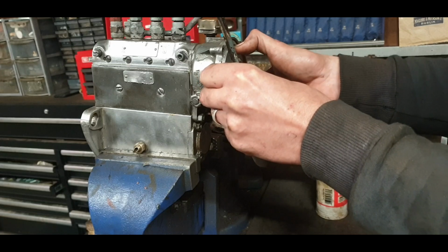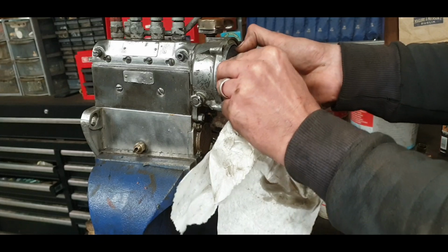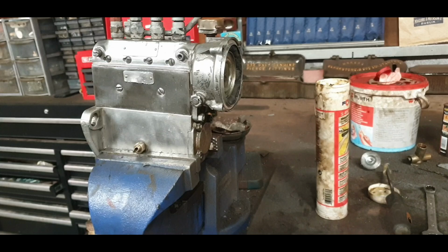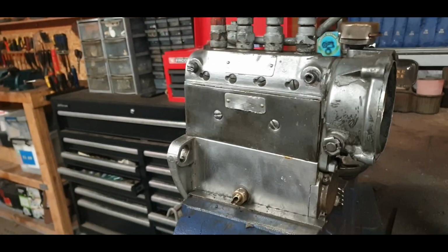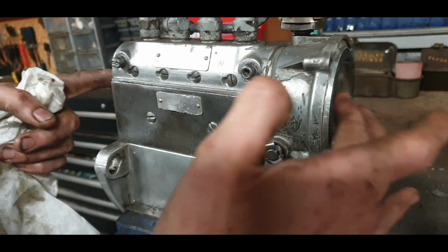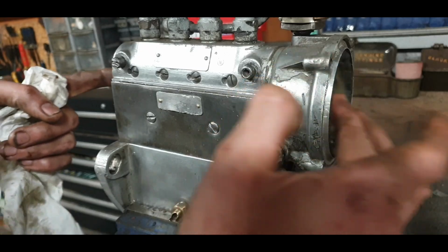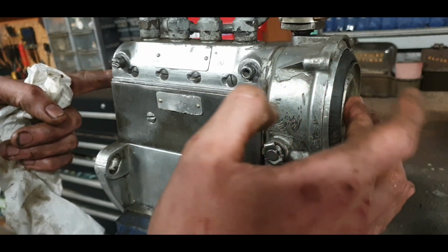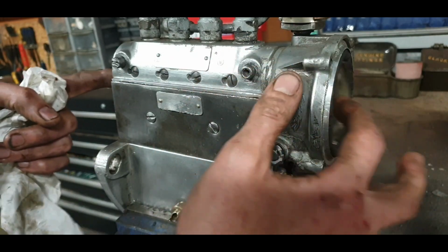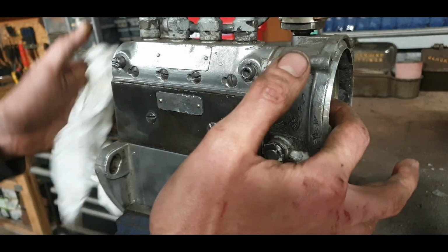Now, as I mentioned already, these racks often do not like to be twisted. If you twist them, they get catchy. So you want to make sure, you can hear it there now, bring it up a little closer, to grab this side and push the rack the other side. You can hear that grease is helping to make that airtight. You can hear it sucking through the air breather. I put a bit of wire wool in there, kind of like you'd use for scouring dirty pots, so it's nice and free. Okay, so that's that.